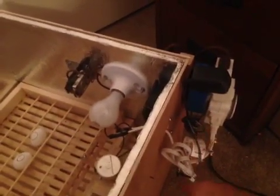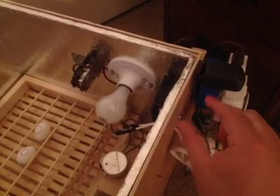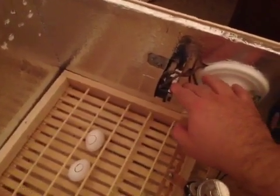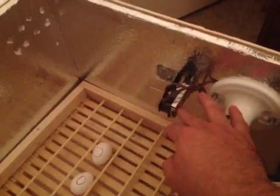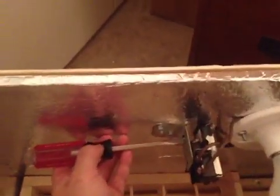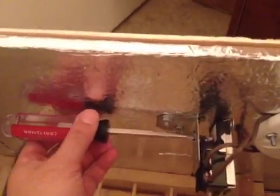I'm going to clean that wiring up in a little bit — cut the wire splices and make them shorter, get rid of the excess. Another key component is the thermostat. It's a water boiler thermostat. I drilled some holes in it based on advice I read online — this makes it a little more sensitive. I also got this little bracket from Home Depot for about a dollar, and drilled a hole so I can just stick a screwdriver in and adjust the temperature setting without having to dismount the thermostat.